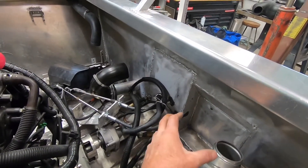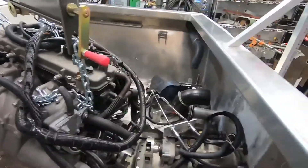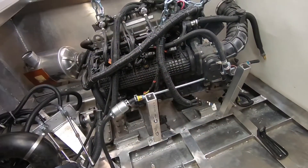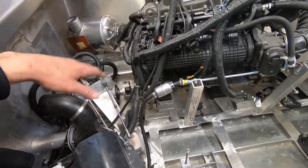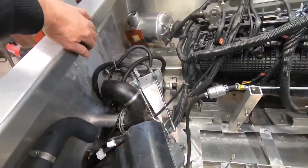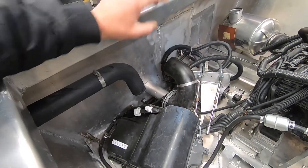It's definitely a little tight, but without the seat on there it's not really a problem. I was able to get the water box past that inset box and turned over. On the other side I have the fuel rail and electrical panel mounts bolted in, so if it's a little tight I can always remove those and turn it this way to lift it out. I'm thinking I'll go ahead and put that mount in, drop the engine back in, and build the bulkhead. I may need to weld flat strap along the edge all the way around, including the backside and inside seam with the engine sticking out — I'll see how that goes.